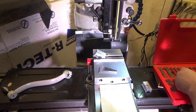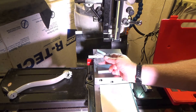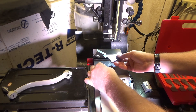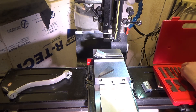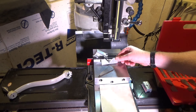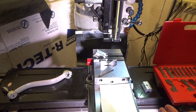These are really handy. You can also stack them, just like the other sets, if you need angles somewhere in between the pre-ground angles - not quite as efficient that way as it makes your flat smaller, but you can still locate a part off of that ledge. I found these on eBay - this was a set made in China, about $50 for the set, and they are precision ground. I haven't cleaned the cosmoline off all of them yet, just the ones I was using. Something to think about - I find them really handy and hope you'll find it useful too. Thanks for watching.